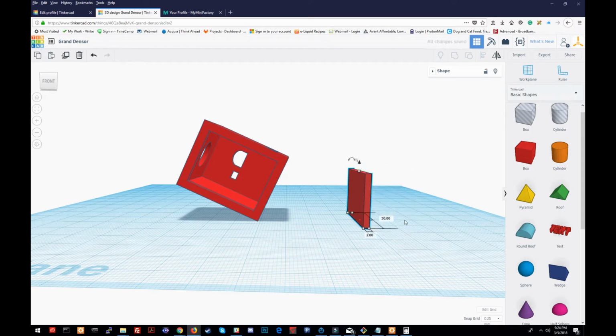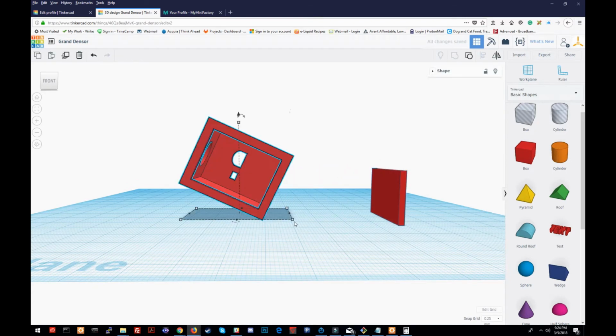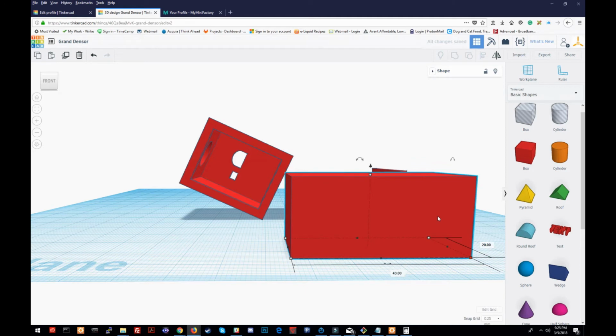So what we're going to do is I set the width to match the camera mount, or the camera holder. The depth is what I set to match, and the thickness is small, 2 millimeters or whatever. I'm going to print these in TPU, which has flexibility and is not just going to snap for being thin like a PLA or an ABS would, the hard plastics that might snap. This is not going to snap. This is going to be rubbery,